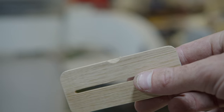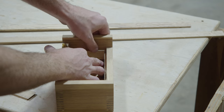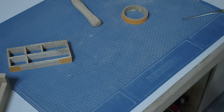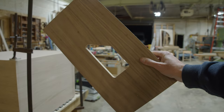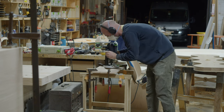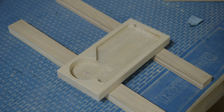I wanted there to be some storage in the box — ultimately I'm going to make a rolling tray for a grinder and some other elements, but I wanted storage underneath that too. So I made these compartments using a piece of white oak that had some serious spalting in it — it actually even looked like spalted maple. This is the template I ended up making for the tray. I made the tray out of ash, so in the end I really did end up making an ashtray even though initially I thought it wasn't a good idea. I routed it out and then took it to the drill press to get a two-and-a-quarter-inch cutout for a grinder to sit in.